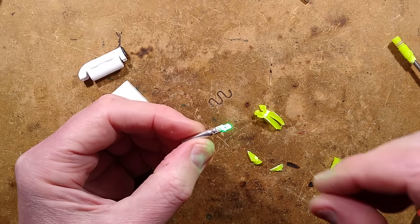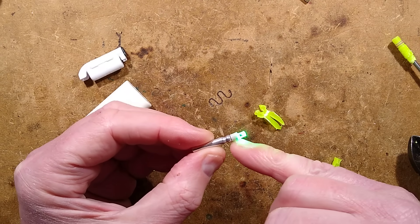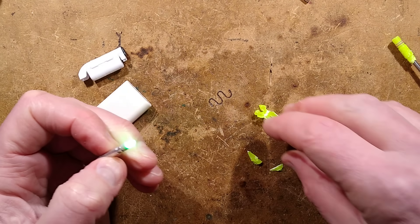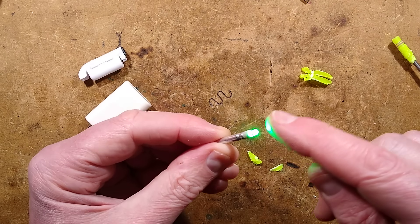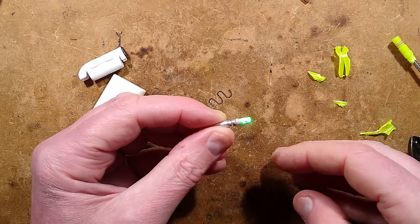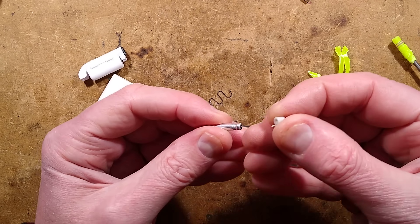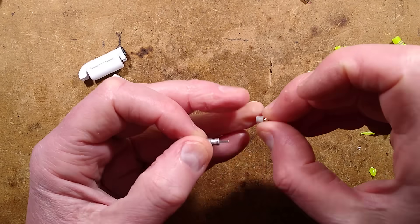It is literally just a little plastic housing with the LED leads pushed in and the leads bent slightly so that as this gets pushed up it simply connects to the leads. I think they've cracked the LED lens to get a wider spread of light. There's no current limiting - it's relying purely on the cell impedance and the LED voltage rising a little bit. That's a bit rough, but that's what they did.